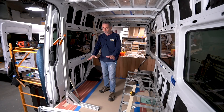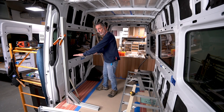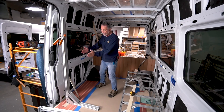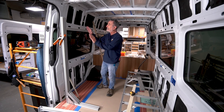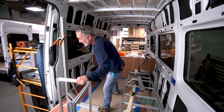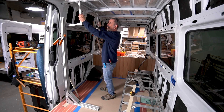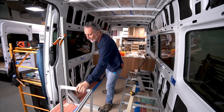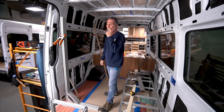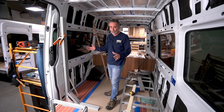The floor is our constant. We want everything to be parallel and square to the floor — the countertop parallel to the floor, the galley cabinet face square to the floor, same thing with this wall cabinet. It's not easy to do. If you watch some of these videos closely, the cabinets are out of whack, off kilter, not square.